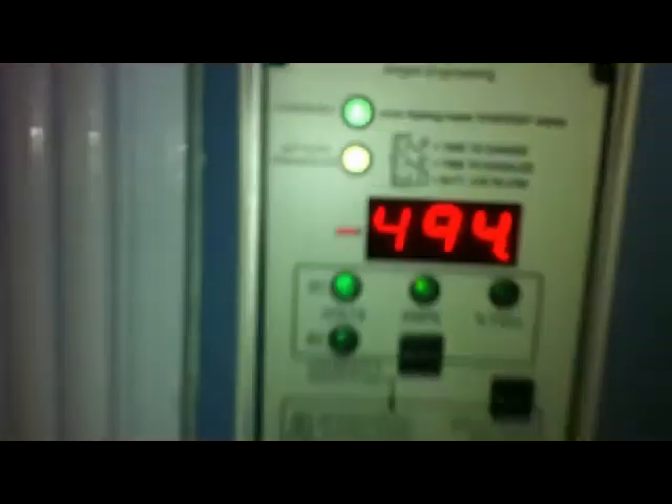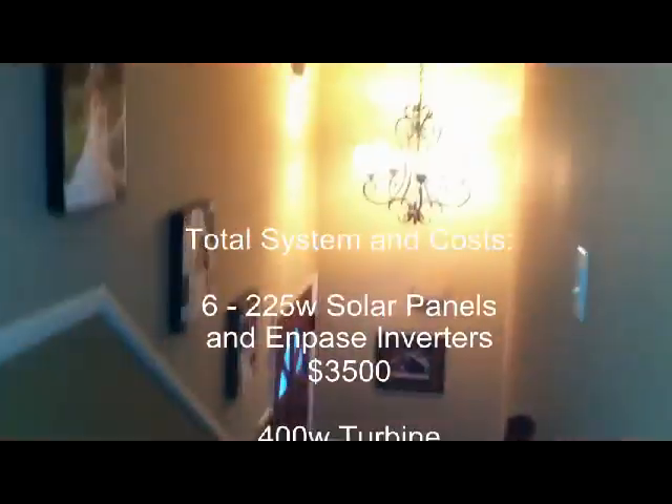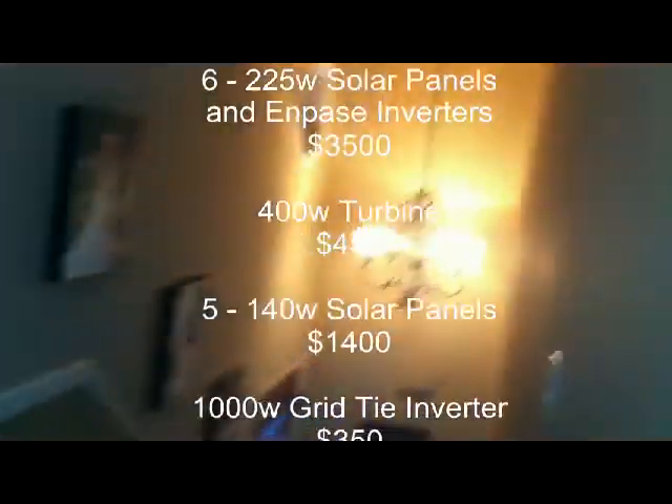Almost 500 watts is being powered. There's the ceiling fan on, there's the light down in the hallway, the recessed lighting everywhere, the bathroom light — and most importantly, the refrigerator. So I'm now running everything I want in this house and downstairs in my daughter's room off those three circuits. That's what that transfer switch box allows me to do.